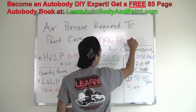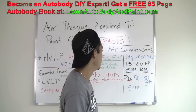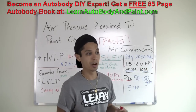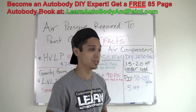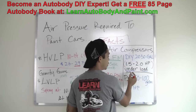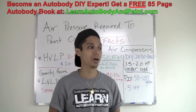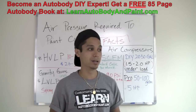Now let's talk about some facts about air compressors. For DIY guys with a small setup at home, you want a 20 to 30 gallon setup with at least 1.5 to 2.0 horsepower — the more volume and horsepower the better. With air compressors, get the best you can afford. A lot of horsepower ratings nowadays are inflated — it's not accurate like the old days when 2 horsepower meant a real 2 horsepower motor. Make sure you're looking at running horsepower under load.